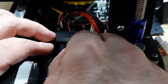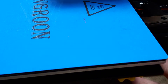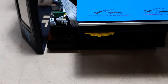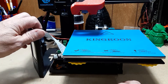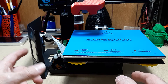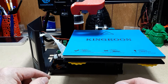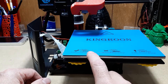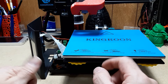Your fan might come wired the right way. If not, it's not a big deal if you plug it in the wrong way — it's just not going to work and it's going to warm up real fast, so keep an eye on it. I tightened down these cable clamps again — the cable is run through here, not very tight but at least in place. I moved everything off to the side, put my shroud off the edge, made sure nothing was touching, and plugged it back in. I tested it — turned the fan on at 100, then at 50. That's actually how I found out the wires were the wrong way. There are markings on the board for plus and minus. I didn't see them the first time, plugged it in, the fan got warm and nothing happened. I switched the wires and they worked perfectly.